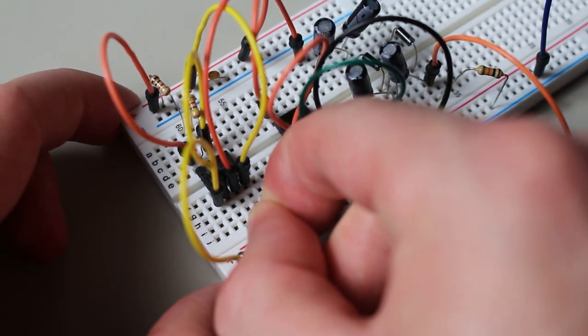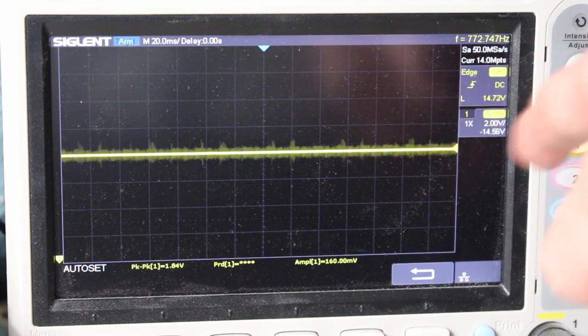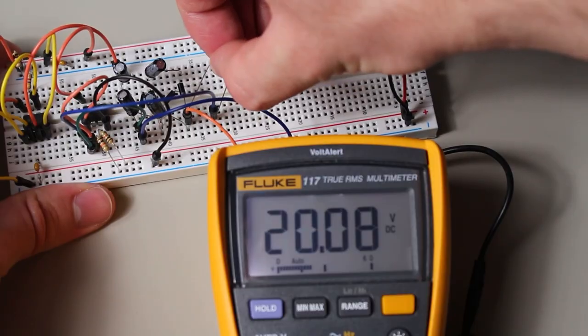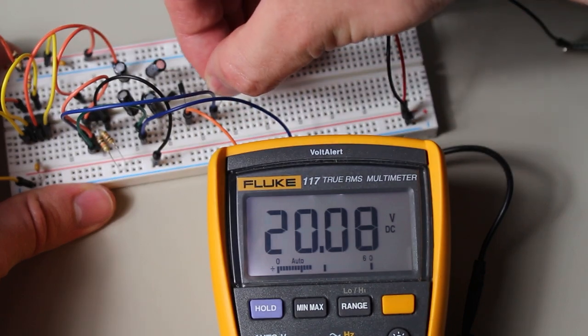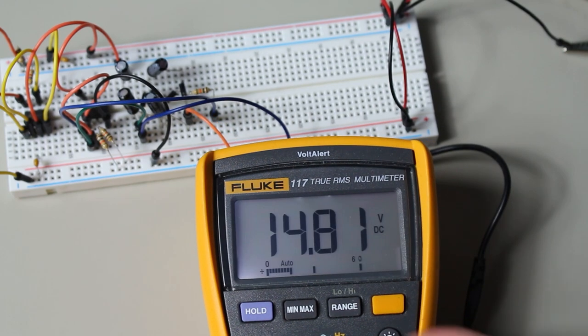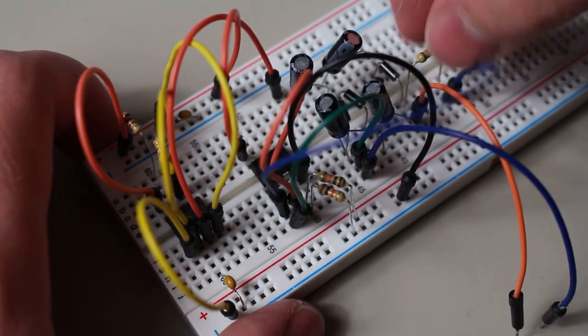So I cranked it all the way up to 1 kHz. And as you can see, the output waveform actually smooths out. This is probably because the capacitor gets pumped up much more often, which keeps it from discharging too much. While this is a good improvement to our multiplier, it's still a bit impractical if you're starting with a DC voltage. It'd be much better if we could avoid creating virtual grounds and intermediate AC signals.